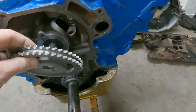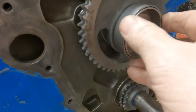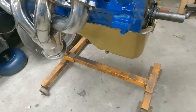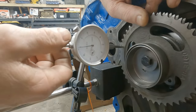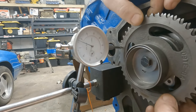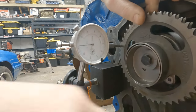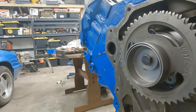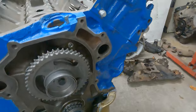Put this on, put this on. It's not torqued but it's close enough. Put the dial indicator on here. That's all the way in, and that's all the way out — seven thousandths. Should be fine. The gears were not in line with each other before — it was about to eat itself. It would have destroyed this motor if I'd have tried to crank it without doing any of this.